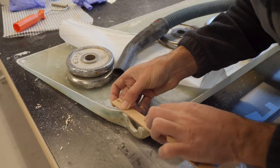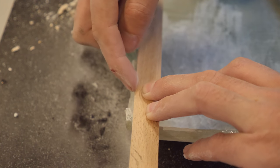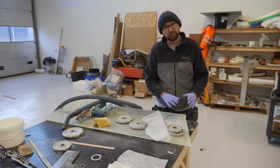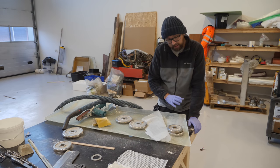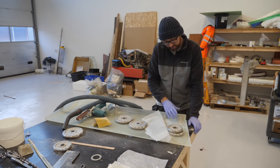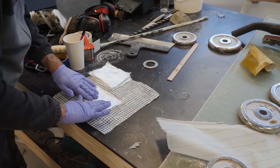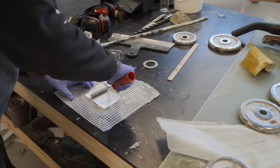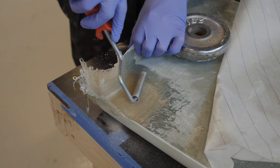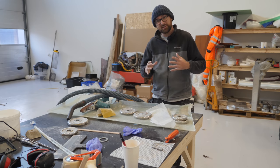I didn't lay up enough glass last night. If I grind away all of the excess fiberglass, the hole for the rudder stock is going to be a very odd shape, so I'm going to have to lay up some more glass in here. The surface is now fully prepped for more glass. Because of the shape of the shell I'm going to wet out all of the glass on a piece of plastic first — it's just easier to do it that way. This should be plenty of glass, but that little mistake has thrown a big wrench into my plans for the weekend. I was planning on getting all of the foam core into this rudder shell and getting it done, but at least this weekend I can blame the jet lag.